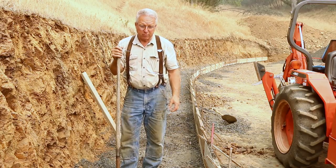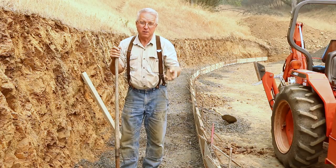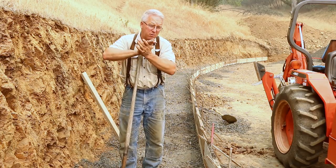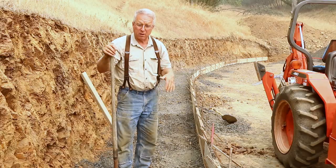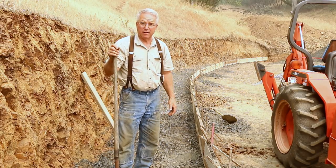and changes the set time. So the three things: calculate the bottom, the volume, compact the base to where it's a nice tight hard subgrade that's not going to compress, and have a uniform set hydration behavior of the concrete once it's in place. So here's how a concrete guy likes to grade gravel.